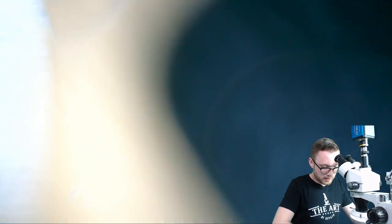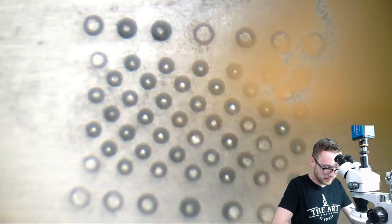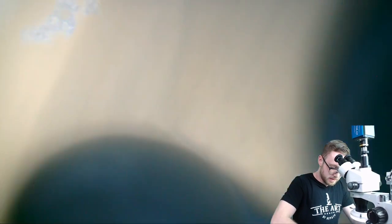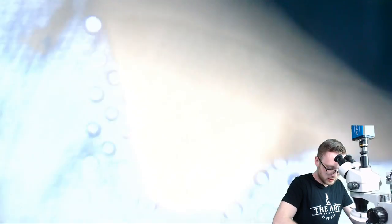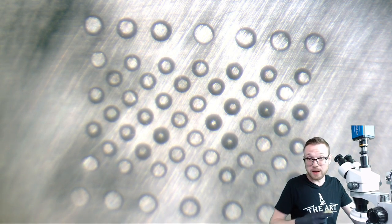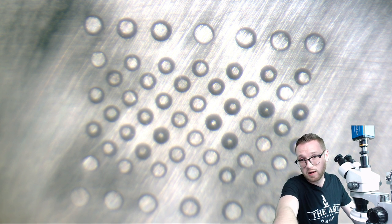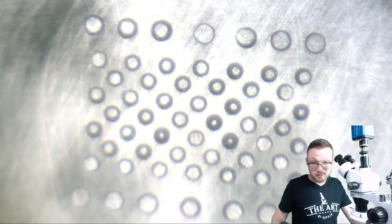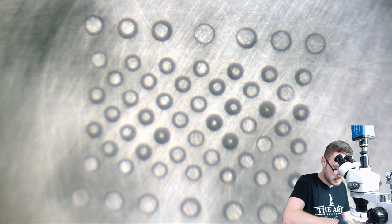And you might even want to get yourself a secondary stencil just to do this with because you're definitely going to destroy the stencil a little bit sometimes. It's going to scratch it up. And as you get more into it, you can actually get a little rougher with it, and you'll start seeing all the lead go everywhere, and you'll start seeing the tops of the actual pads themselves. You can see it right there. I forgot you guys can see it. There's a couple there that are a little low, but you can see that they've got a little bit taken off the top, and that's the key. Once we get this to the same level, then you're going to be all at the same level, and the solder balls are going to be perfect.